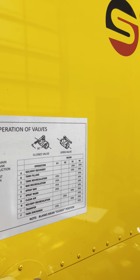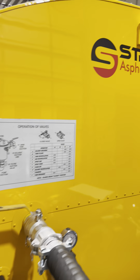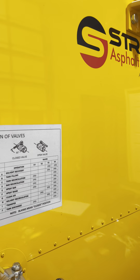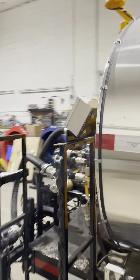The first operation is solvent recovery because we have all the solvent in the line and we need to get it back into the solvent tank. In order to recover the solvent out of the system, valve one will need to be closed. Valve two will also need to be closed — this is the valve that sucks from the solvent tank. We will have valve three open, as this will allow clean air to come into the system, go through the pump, and force everything to the rear of the machine.